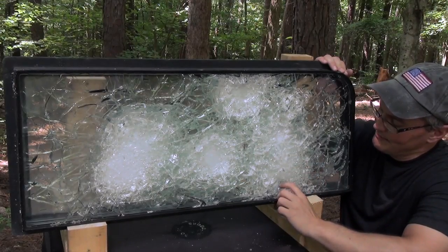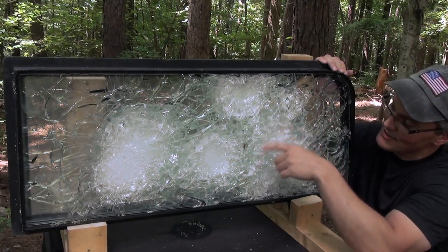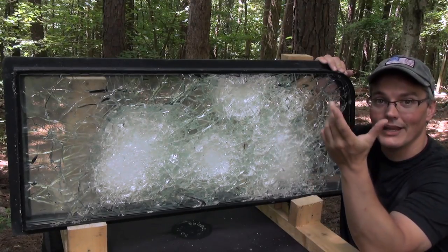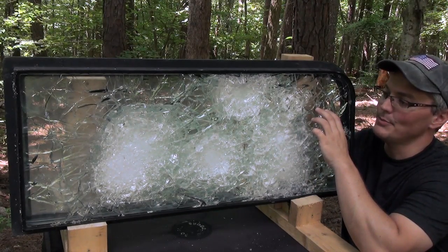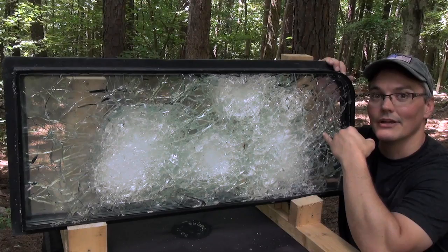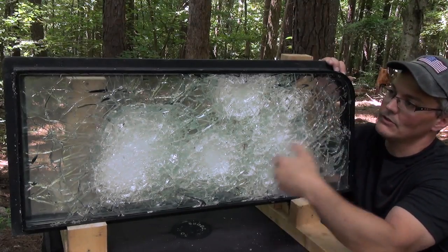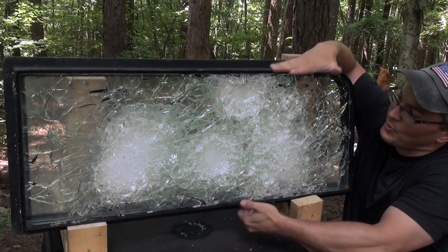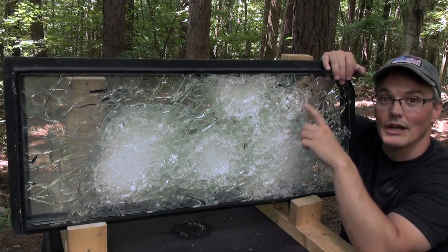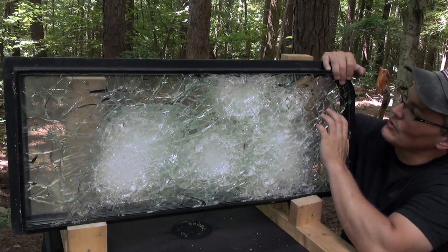In the camera shot from when I fired this from the correct side, the glass that's missing actually sprayed back at the camera — that's energy taken away from the vehicle and the occupants. This works partly because glass is inflexible, so each subsequent layer of the laminated panel prevents glass particles from going towards the vehicle. It's also because the steel frame is pressing sideways, so it doesn't allow the free particles of glass to escape sideways. Overall, it's really neat to see how glass can work as armor — sometimes even better than a steel panel of equal size, and certainly one of equal weight.